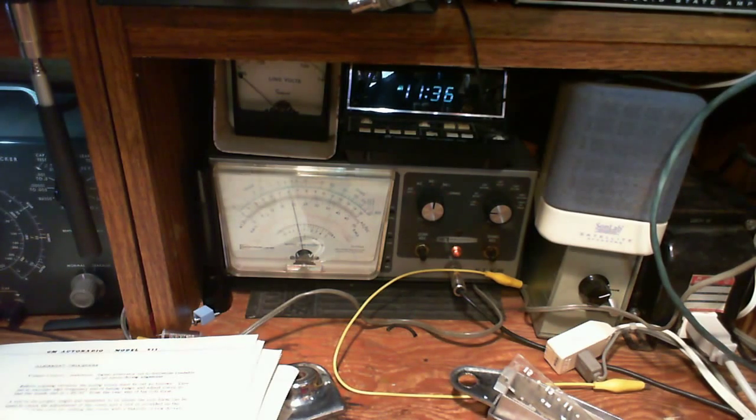Again, when I bring the screwdriver up, it doesn't do anything. Here we go. Oh, see, what was that? Uh-oh, I don't like that. I'm just wiggling all my test wires. I think it's just my test setup. Okay, once again, back to trying to adjust this last IF transformer. Here we go. Very small variation, so we'll leave it roughly where it was. It didn't seem to be a very sensitive IF coil. I hardly made any improvement here, just a very slight improvement.